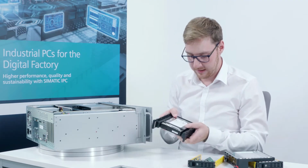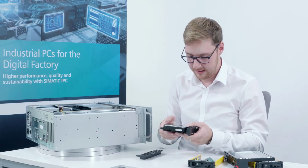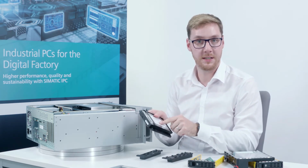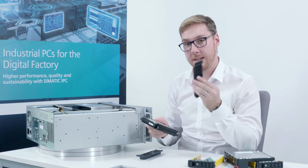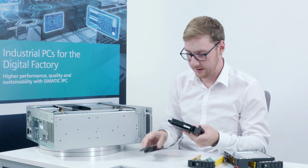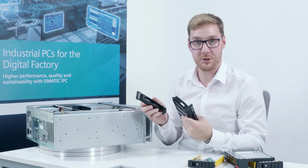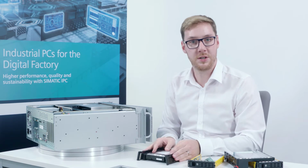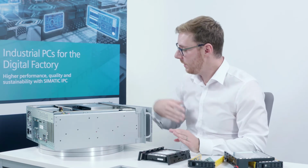I would like to immediately start with the upper 5.25-inch drive bay and put in an additional fixed installation drive here. To do so, I have prepared everything here, so that in this case I have already installed an HDD with 4 screws in the drive mount. I simply have to press on the included mounting latch on the side here, whereby you need to pay attention to the left and right label, and then the entire carriage is already prepared for installation.